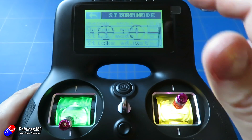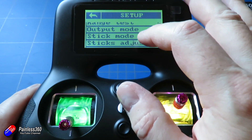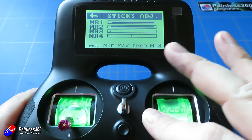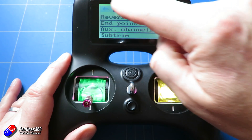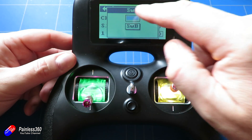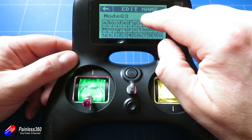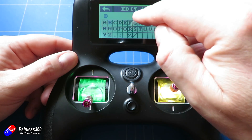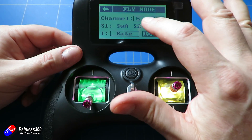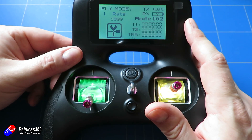You can adjust the sticks in the menu between different modes, but I recommend just buying the mode you want from the Hobby King website. The receiver that comes with the radio is already pre-bound, so it's just a case of plugging it in and doing the setup on the radio. One of the cool features carried over from the original Evolution is flight modes: you can set up different flight modes on a switch, name them, and see which mode you're in on the display — typically angle, horizon and rate mode. You can even combine the two back sticks for a six-position mode switch, so for iNav you could set up angle, horizon, rate, GPS loiter, and GPS return to home, all displayed on screen.